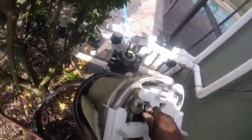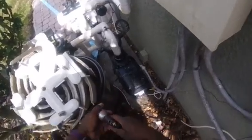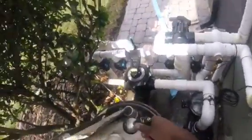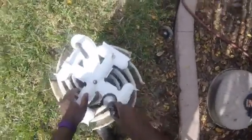Yeah, you can see, man, it's nice and clean in there. These grids came clean. Now there is a plus that this is a shorter set of grids, that's a plus. And to be honest, these grids aren't that bad. We can probably pull the plug in this filter and be okay. Then once you get most of it out, just pull them out, bring them over here. You can finish this right here.